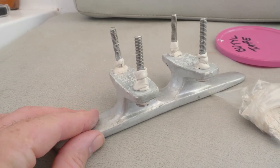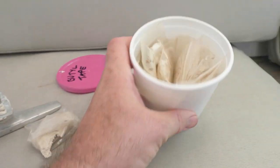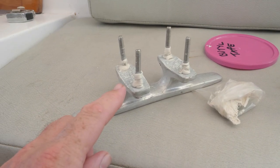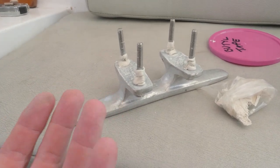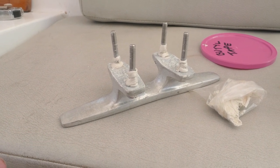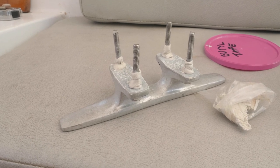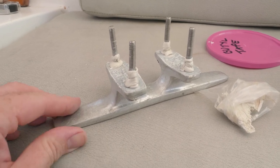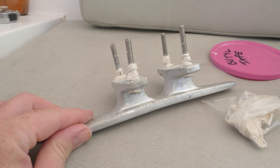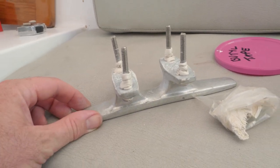It's very easy to work with and you get quite a bit of wastage, so a lot of what you see here is actually the stuff I saved after using it. It extrudes from the sides and also tends to extrude over a period of weeks if not months. Sometimes it's worth going back to the fitting and tightening it a little bit more. It's non-adhesive and very easy to work with, and a deck fitting like this actually requires two people to put it together ideally.